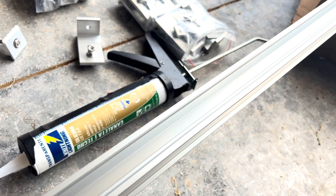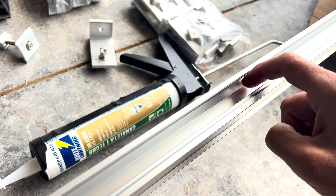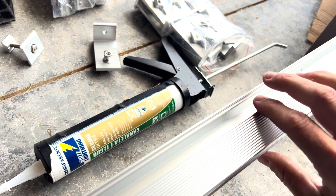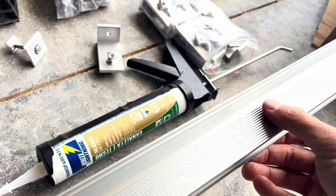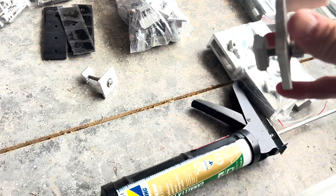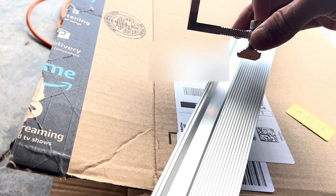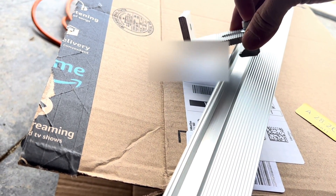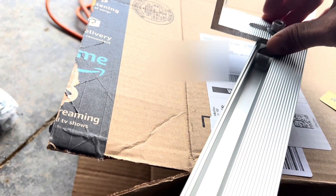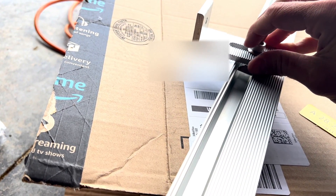Here's how the different pieces in the kit go together. The rails are mounted vertically so that your solar panel clips go in the top in the skinny part, and the wide side with the ridges is where the feet go. To connect the different pieces, you'll see that one side is fatter than the other. Slip the skinny side down in there and it'll hold it in place. Then you tighten that top screw down and it'll tighten the foot up to the back of the rail.